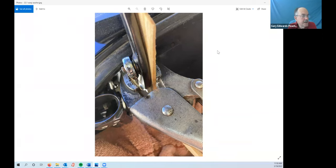One other thing you need to do: you never want to put a scratch on the piston rod. Any time you're disconnecting cylinders, the first thing you do — as you see in the Top Hydraulics guidance — is fully compress and push the rod all the way back into the cylinder so you don't have exposed rods and don't inadvertently scratch it.